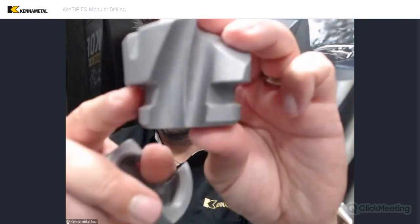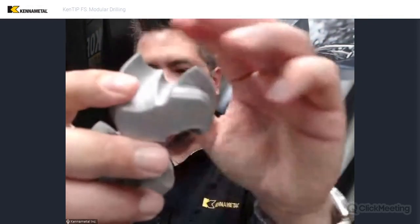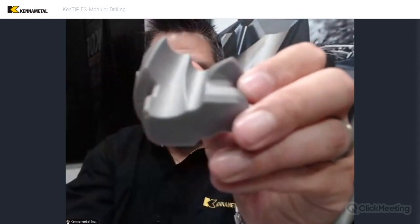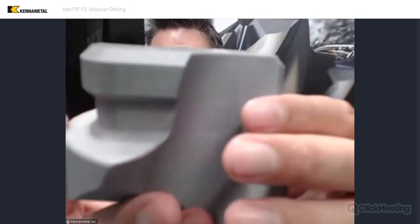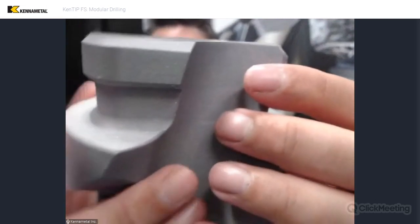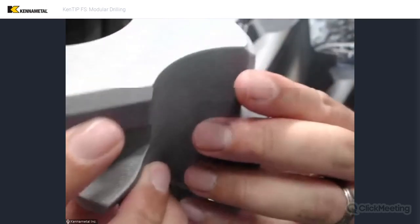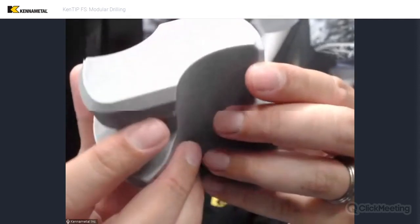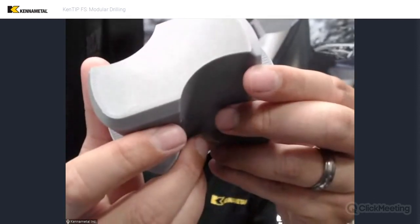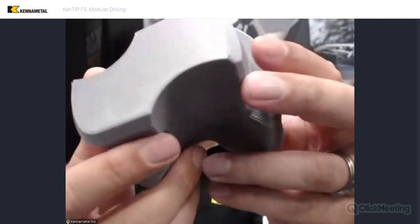It's both tapered in these areas, and one of the things I really want to point out is what we call the drive block. I'm going to go to a bigger 3D model here to get it to focus a little bit better. This area here is what we call the drive block, and if you look at that, you can see just how wide and how big it is — that is what's providing your torque, your torsion transmission.